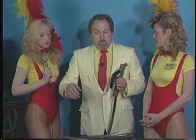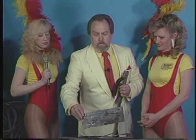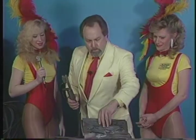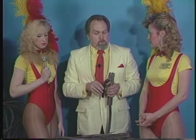In fact, what I did with the girls was that they were fooling around with this stuff, and this is just 20 gauge, a normal practice thing for oxyacetylene. And I went and stuck a piece of 1/8 inch, which I have around here somewhere, I hope. But I have a piece of 1/8 inch steel that I put under there and said, okay, go ahead and puddle this, and what happened? It didn't work. It took forever to get a puddle. Yeah, it takes forever to get a puddle, so it becomes impractical at some point. And whenever you get into something heavier than 1/8 inch, I recommend that people consider stick welding.